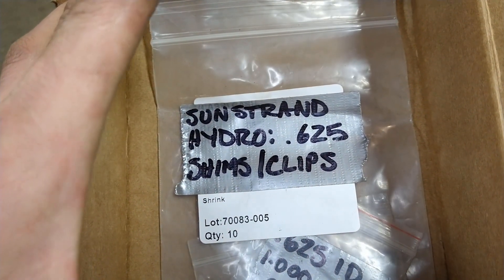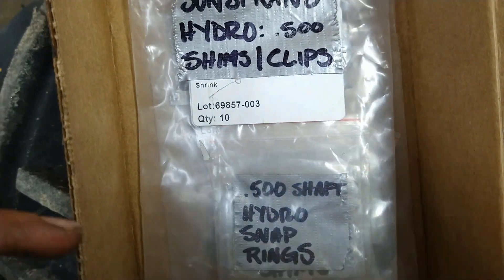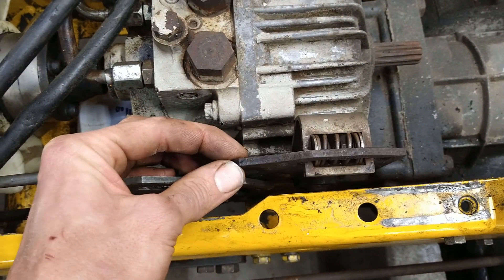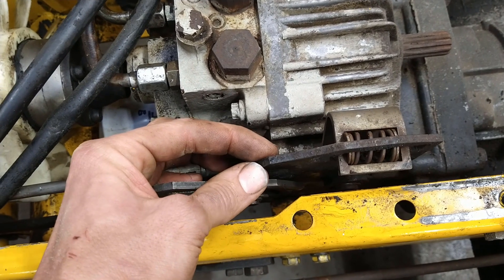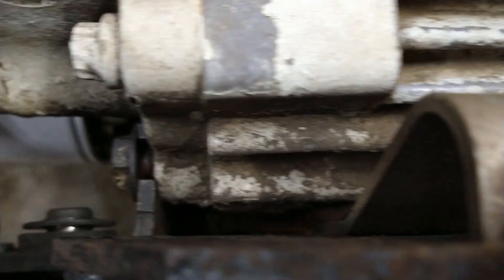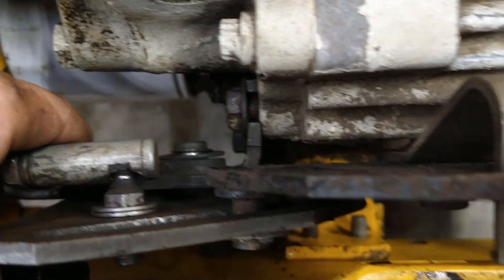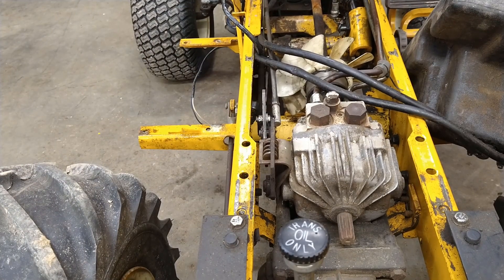We have primarily the 500 clips or the 500 shims — half inch shims in two different thicknesses, a 5-thousandths and 10-thousandths shims that are 500 ID. And then with a 5-8ths ID and a 6-25 ID we have the same pair of shims at 5-thousandths and 10-thousandths. We've got some new snap rings too, just to make sure everything stays on there nice and tight. Whatever slop is left over after we replace this plate — because inevitably there's some wear in the mating part too — we'll take up as much of that slop as we can by putting a shim between the pivot points. We'll put a shim in between the retaining ring and the plate so it can't rock back and forth.